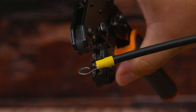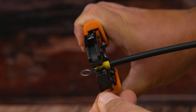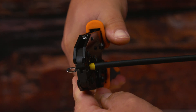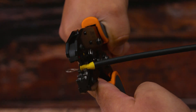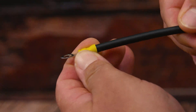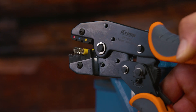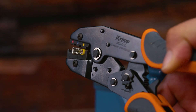Looking from a different angle, we like to start our crimper from the top and crimp. You can always look inside the wire terminal to see how far up or down the connector is, and get an idea of where you want to crimp. Always remember to use both arms for an even crimp. And the most important pro tip: after you crimp, pull on the wire connector to make sure that it is securely in there.